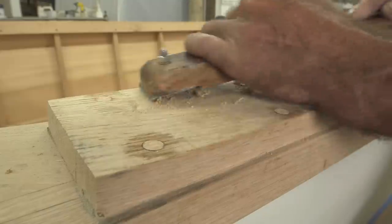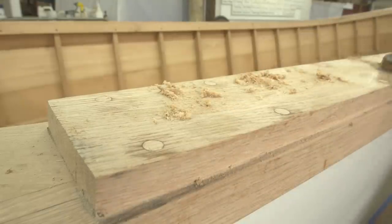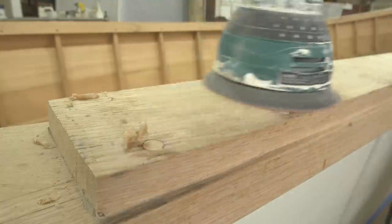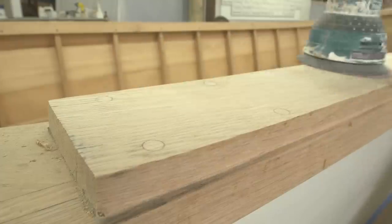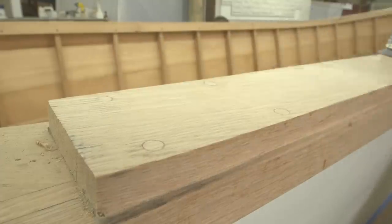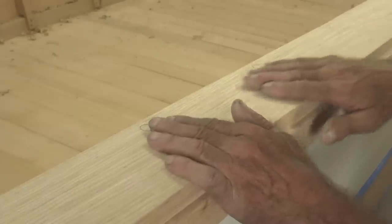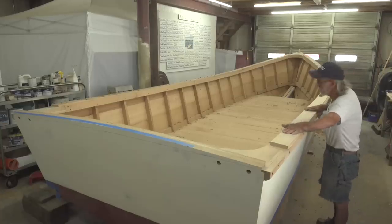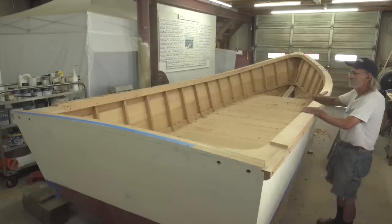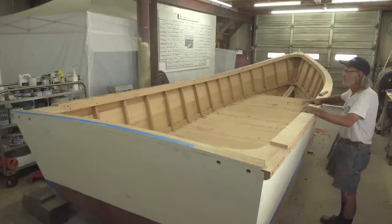I'm running a scraper over the top of the plugs to get that very last little hump off before sanding. Then I take a random orbital sander with a rough grit and go over it quickly — that makes it look perfect, but I've got a couple more weights of paper to go through to finish it up really nice. That's what it looks like: scraped down and sanded off, nice and smooth, feels great. There are more plugs to clip off up forward and down the other side, but it doesn't take very long — we're just waiting for the glue to dry.